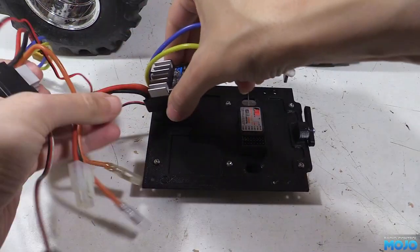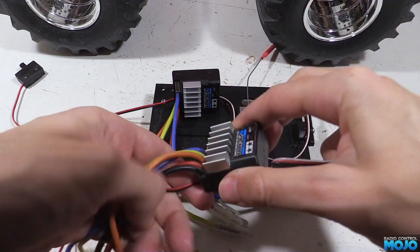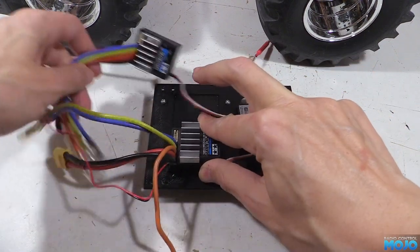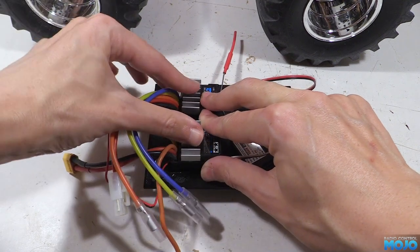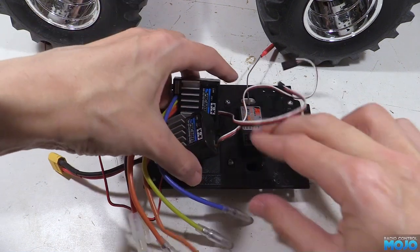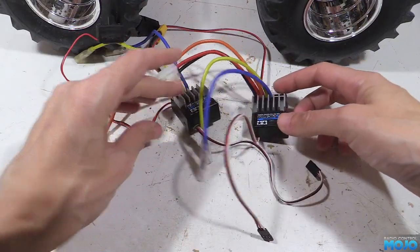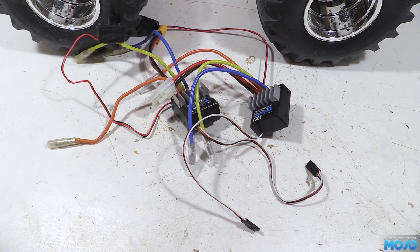Next we have the ESCs. I'm using these partly because I'm trying to save some pennies as I've already got them, plus they're Tamiya which goes with the truck quite nicely, but mainly because they do both brushed and sensored brushless motors, so they'll still do the job when we do a motor upgrade. They do have a problem though — according to Tamiya they're not LiPo compatible. The motor driving side of things is more than up to running off the 2S LiPo; the difficulty comes from the cutoff voltage. Out of the box the ESC will happily run the battery all the way down to 5 volts, which with a NiMH is a little low but recoverable. If you take a 2S LiPo down to 5 volts you'll almost certainly do permanent damage to your battery.